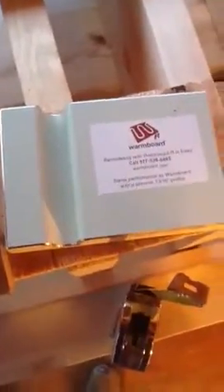Another thing about the WarmBoard is it has this aluminum panel — 0.025 thickness of aluminum — and it's got paint over it so I don't get blinded as I'm putting it in. I put this WarmBoard down, drywall, anything I want — I'd still cover it. It's a sturdy product. And that's how the WarmBoard is going to look when it's down, with the pipes in it. They have different patterns depending on how you're going to run it. That space at the top would be like a plumbing wall, so it's okay to drill through it. No matter what, you can't hit a pipe because they're all exposed until you cover them up.